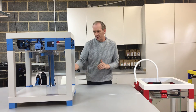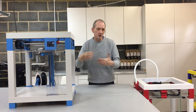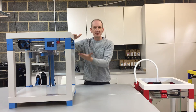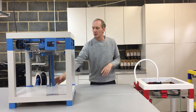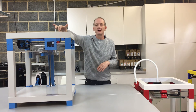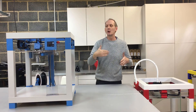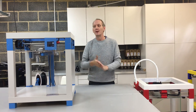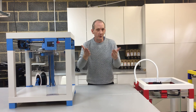In the next video, I'm going to go into the detail of showing all the changes, and I'll also show you right from the very beginning — again, how even simpler it is now to get the frame built and get the axes in. There's no drilling on the legs, no feeding wires through the legs anymore. All of the wires now just come up through the center and through the inner top part of the roof frame and drop down. We've also added an energy drag chain so the wires can run through to the print head. In the next videos we'll be showing all of the changes, and we'll also have uploaded all of the new STLs for this build. Please subscribe to the channel if you want to see more development on the print table, and I really do appreciate everybody's support.